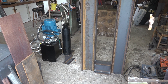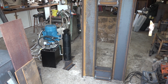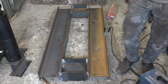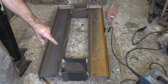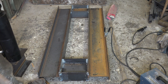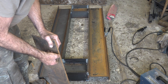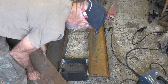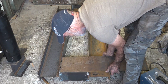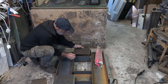That kind of gives you a bit of a visual. Welded that up — it's nice and parallel and totally square. There's the ram that's going to go inside. I'm happy with them welds — good thick strong weld, welded each side of that web, and I know that's not going to move. My next task is to cut this eight millimeter thick steel plate — that's about three eighths or somewhere around there — to fit inside that webbing. I've put a couple of little blocks in there, just some tacks of weld to hold that in place.